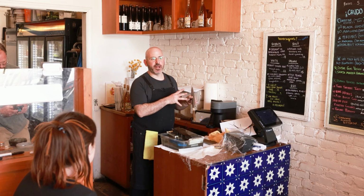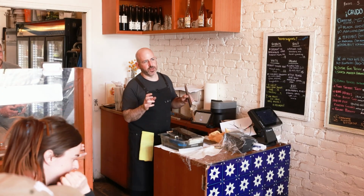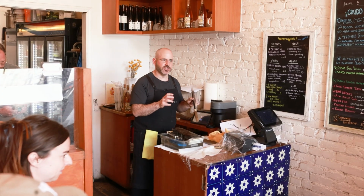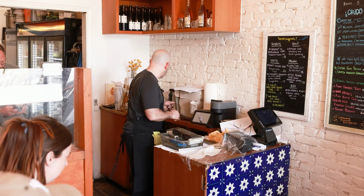But you can really spend a lot of time making things look very, very pretty. And there are ways to accentuate, for example, the hard and soft steel. We use like a powder. Some people use natural stones or finger stones, where it's harder than the soft steel, but not as hard as the hard steel. And so it scratches them up in different ways, and it creates a really beautiful misty-like finish.